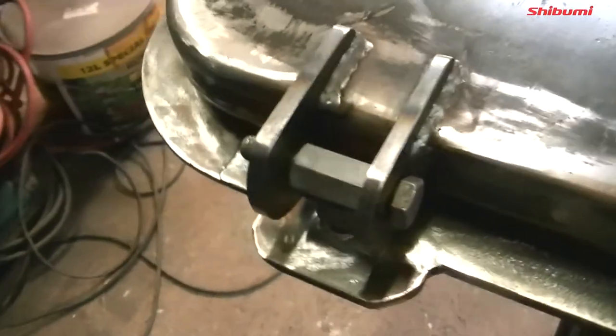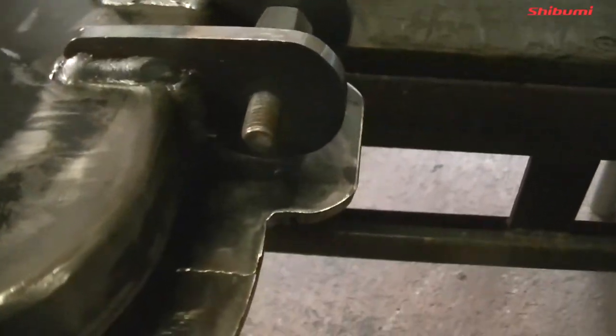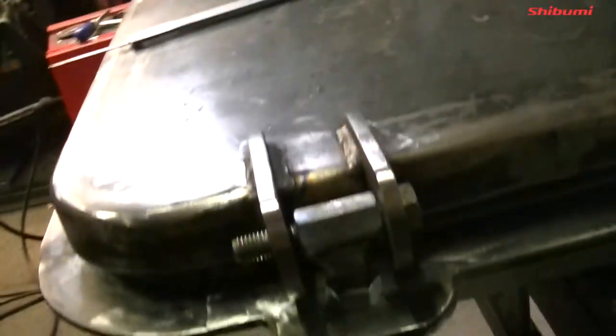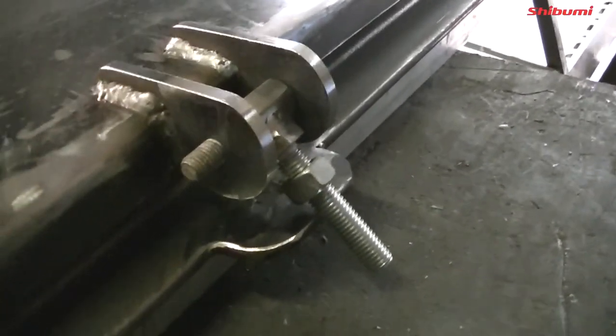So this is one of the three hinges I've made. I cut out all the little parts, these little number sixes. And there is an M12 bolt into this. It's just not spaced right now. There'll be a stainless washer either side. And this one I've just left out purely because the bolt would have been hitting the table. But you can see the mechanism.